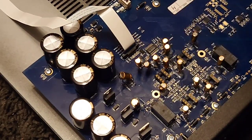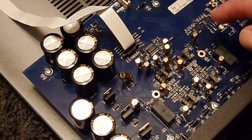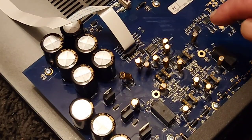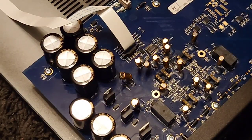I have a customer who's an electronics engineer and I spoke to him about it — he says they do it all the time. If a surface-mounted capacitor goes bad they just nip it out and put a through-hole capacitor in, just bending the legs over and soldering them to the pads. I've done the same and put a bit of epoxy over the top to hold them in place, and I can tell you they've already made a lovely improvement.